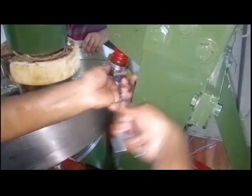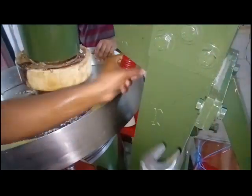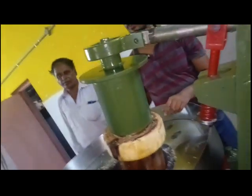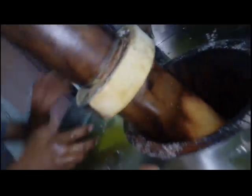After removing the cake, you can remove the pestle and clean the inner area of the machine. To remove the pestle, just loosen the springs and all the adjustments given to the pestle, then remove it to clean. In the same machine we can process groundnut, sesame, and coconut. After running coconut, just clean it with a cloth and use any other raw material to produce oil. The pestle weighs around 20 kg so you can remove it manually — it's not too heavy.